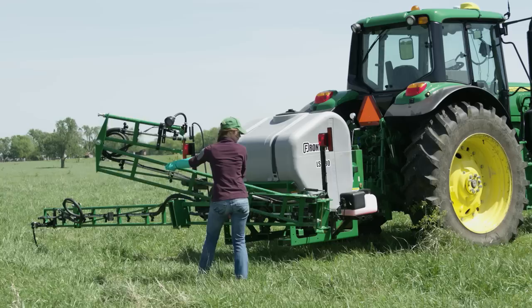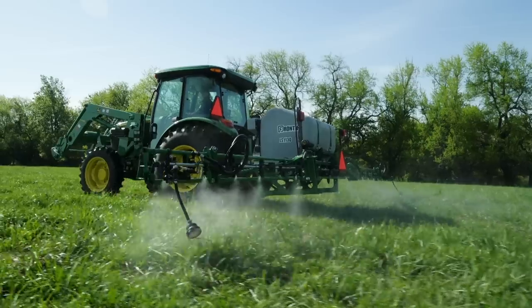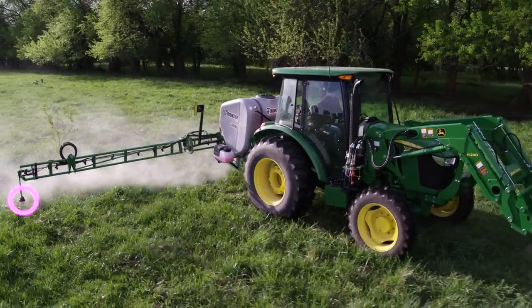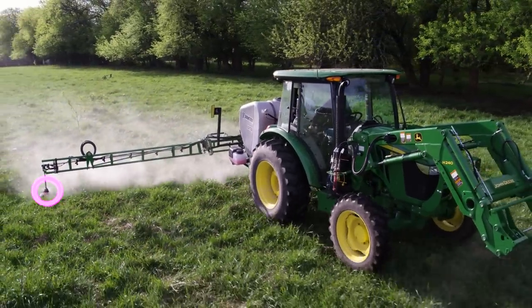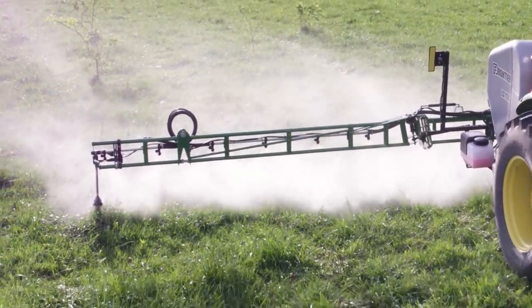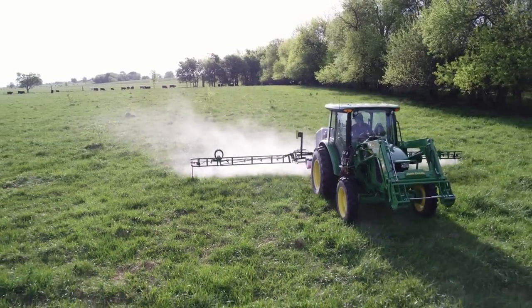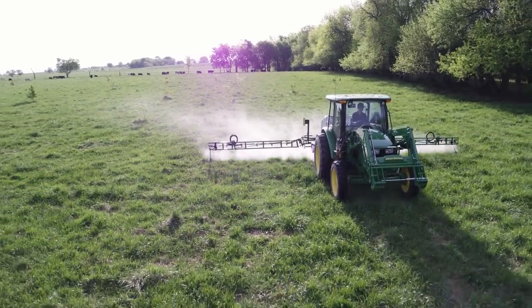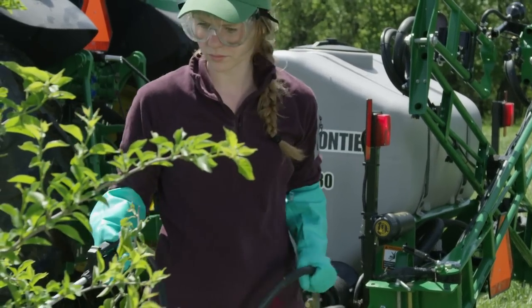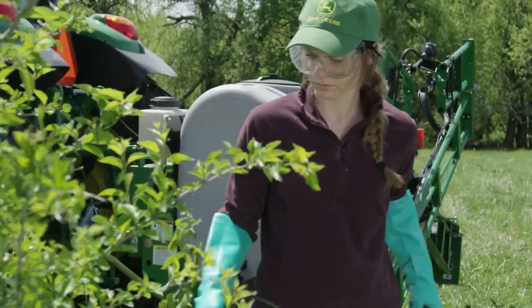She'll unfold the left side first, then the right side the same way. The LS1130 has 18 single-body nozzles across the 30-foot working width. An optional foam marker at the end of each boom arm is available. Using liquid foam from the attached foam tank, it marks the path where chemical has been applied to help prevent skip and overlap while achieving complete coverage. For hand spraying along fences or spot spraying weeds or other vegetation, each model comes with a handheld spray wand with a coiled 30-foot hose.